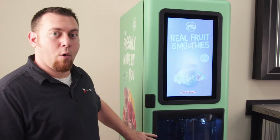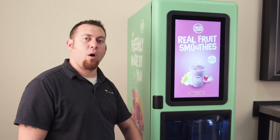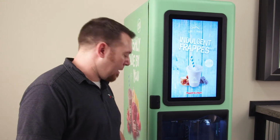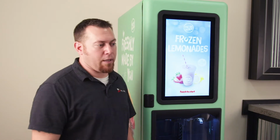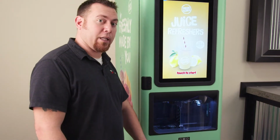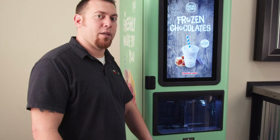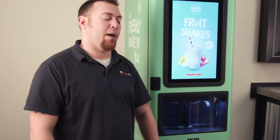In this video, we're going to go over some issues that can be reported with water in the cabinet. Dripping or excessive water sometimes can be reported. Normally, a lot of the main causes are product bags not properly in place, or not in place at all during the weekly cleaning. This will allow water to get pushed into the cabinet during the cleaning. That's normally the main cause for water in the cabinet.